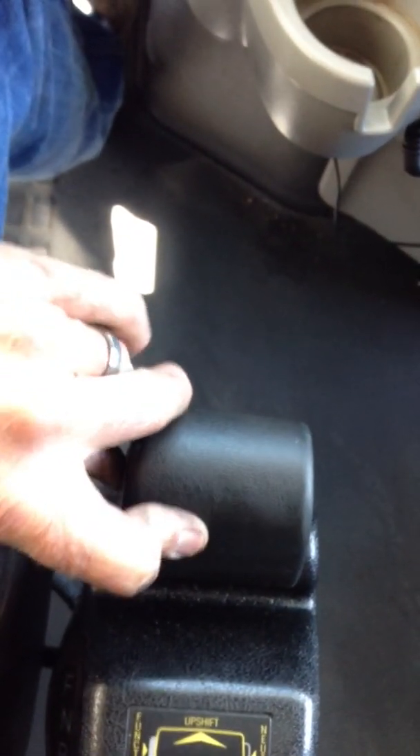Many times driving this unit around town, you can give the passengers a smoother ride if you go into manual transmission mode and skip gears, shifting at low RPM. This takes a little bit of practice, but it's all about being smooth — we're not in a hurry, we're trying to not jar the passengers around in the back. The other function of this button is it changes the transmission from auto shift mode to manual shift mode.